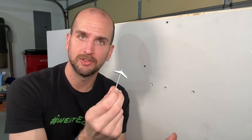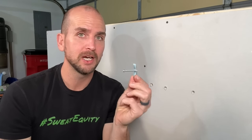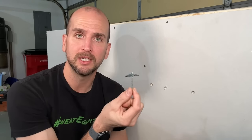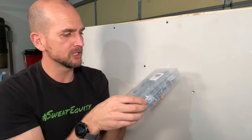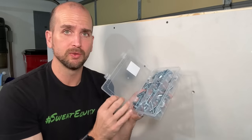There are a ton of different options out there, but the toggle bolt has been around for a long time and it works great. This is a one-eighth of an inch toggle bolt, two inches in length — a great general purpose one I keep in my kits. I also carry some three-sixteenths, but you can get combo kits that have one-eighth, three-sixteenths, and even up to a quarter of an inch — which honestly I don't use that often.